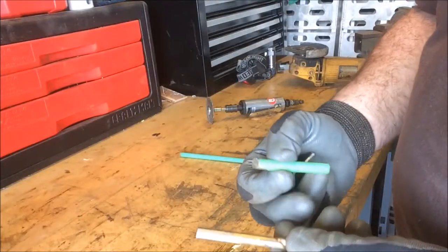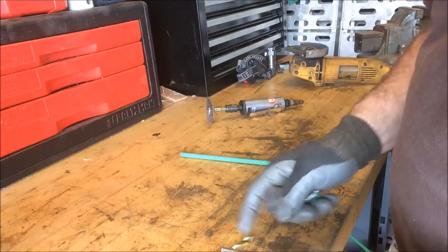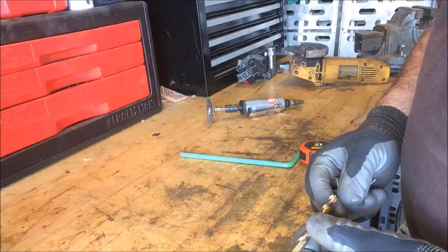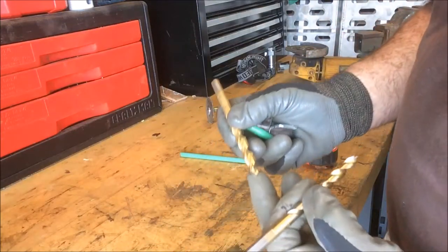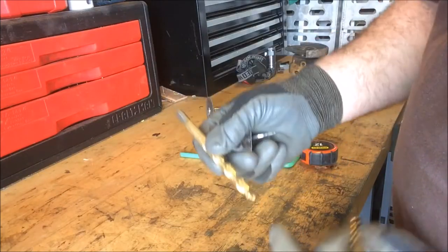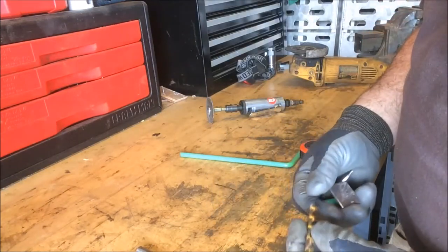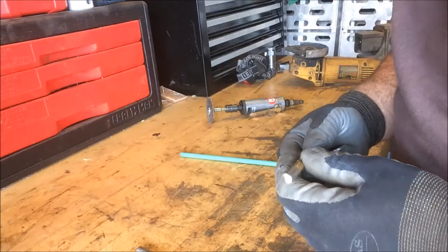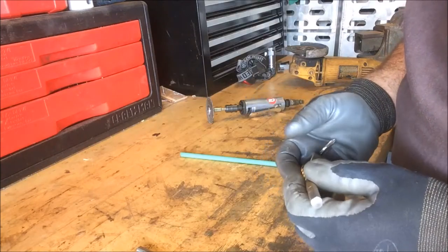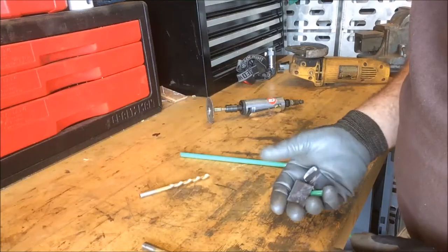The stock is 5/16ths and this is a 5/16ths drill bit - I don't know if that'll be too tight, but I've got a 3/8ths here that'll work if this one doesn't. However, these have the pilot-type bits, so you don't really want to drill with this and then try to drill with this one - it's not a tapered bit. So you pick one or the other. I'm going to take a piece of raw scrap stock and drill it and see how it fits. If it doesn't fit well, I'll step up to 3/8ths.